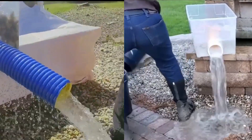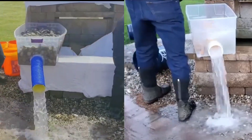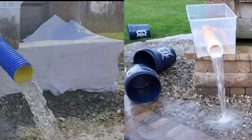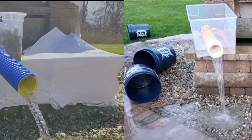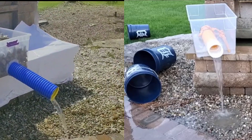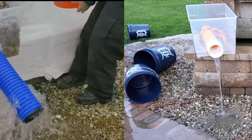Everybody wants to know what's the difference between eight-slot yellow versus eight-slot blue. We took footage from last year when I raced eight-slot yellow against ADS pipe with 20 gallons, and ran the same time to measure the difference. We put 65 gallons through high octane in the same amount of time it took eight-slot yellow to drain 20 gallons — that is a huge difference, more than three times the water in the same amount of time.